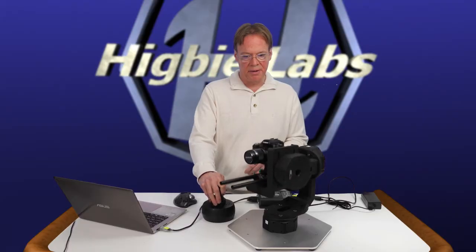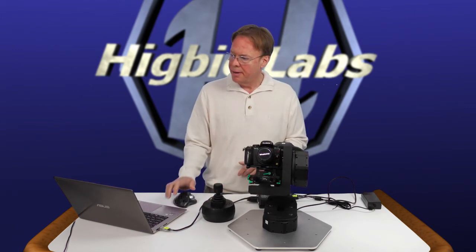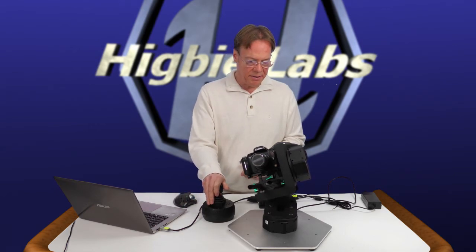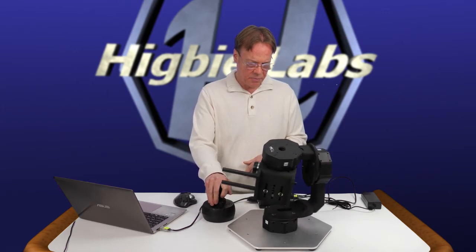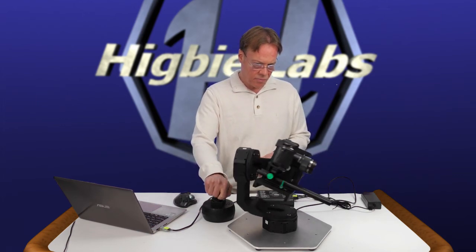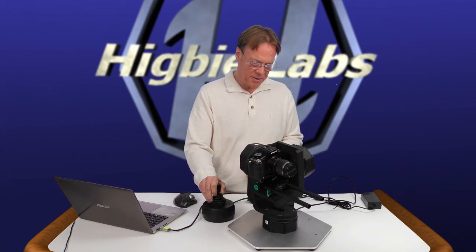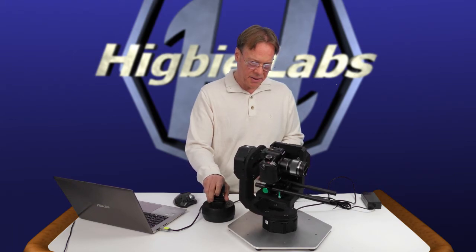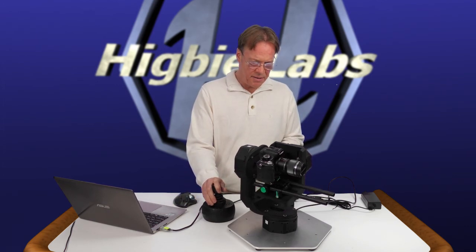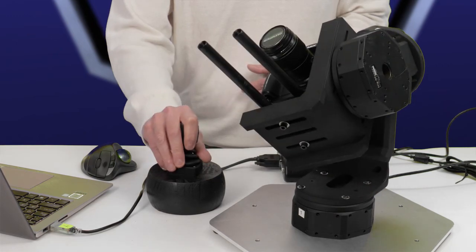That noise seems to be coming from the pan, which we did leave a bit hot. So I'm going to bring up the damping on that pan, which did bring down the noise quite a bit just now. And how are we for smoothness on pan? It's a little bit stuttery, so I'm going to bring smoothing up, which we could do now that we've brought the damping in, and that's looking very nice and smooth.